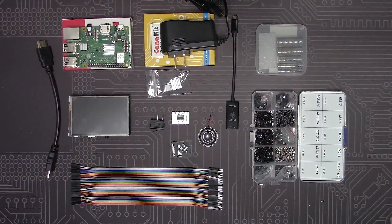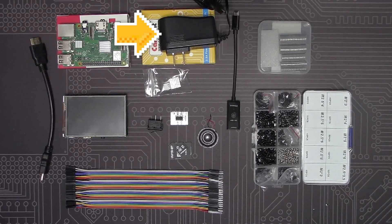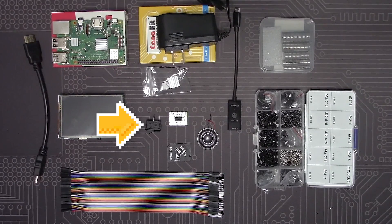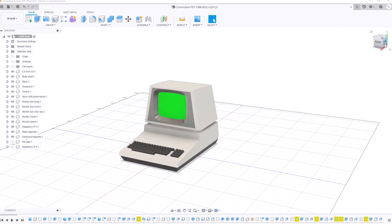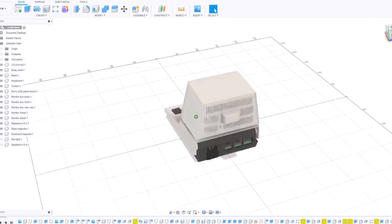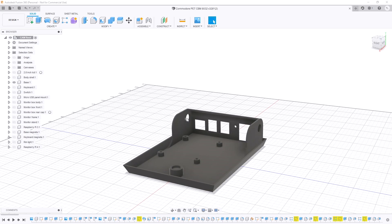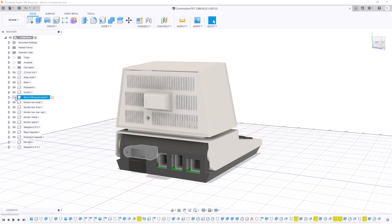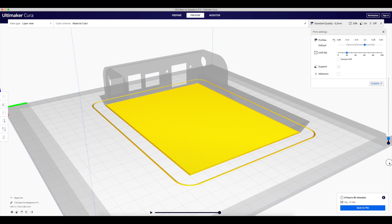So here are our recipe ingredients. You can find links to the full recipe in the description below. We've got a Raspberry Pi, power supply, heat sinks, a screen, GPIO cables, a piezo speaker, switches, mounts, and magnets. But first, we need something to put them in. Here's Lorenzo's model fired up in Fusion 360. These are our hinge holes, this is where the magnets go to snap the case closed, here's our Raspberry Pi, and the rest of the case including the screen mount, power plug, and switch. Let's start sending all our mini parts from Fusion 360 into Ultimaker Cura for 3D printing.